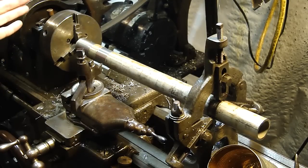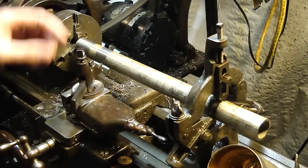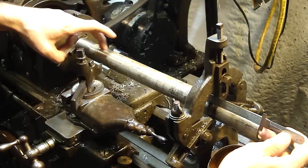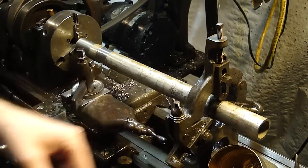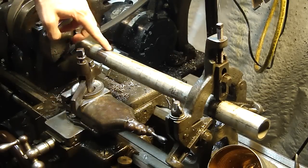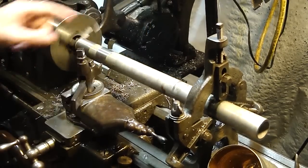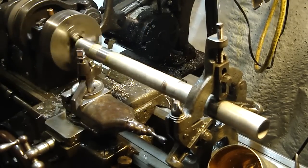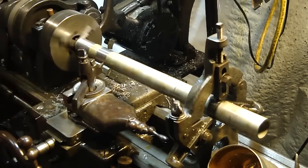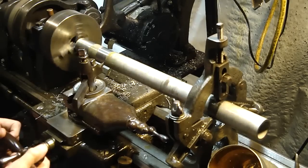So first thing I'm going to do — right now I just have it rough set up and I did dial it in. I measure back to see where I need clearance and I'm going to create a bearing surface here that is perfectly round and true for these jaws to ride on. Then I'll show you how I dial it back in when I flip this bar around, because this is a different size radius and the fingers will have to be adjusted. Right now I'm just going to clean up this bearing surface — I made a rough pass so I'm going to go back over it kind of slow and make as smooth a surface as I can and touch it with a scotch-brite pad.